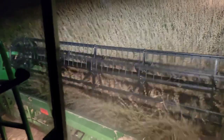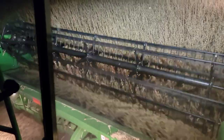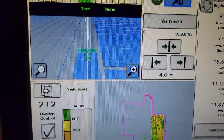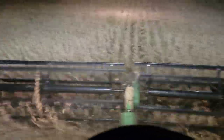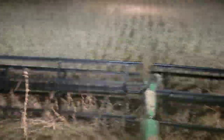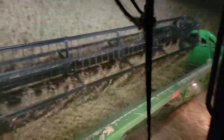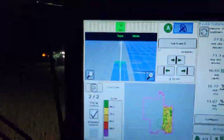I'm tired of being frustrated fighting this head pushing, so I'm going to try a new approach — we're going to run on a little bit of an angle. We're at 357 degrees, as Brock just said. What that does is instead of the rows being in the exact same spot on the cutter bar all the time, we're constantly working across them. Hopefully if something starts to push, it'll work across into a different spot on the cutter bar and sort of free itself. We're going to have a wedge, but we'll deal with that.